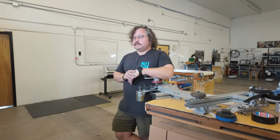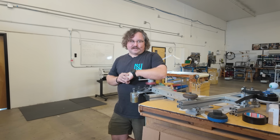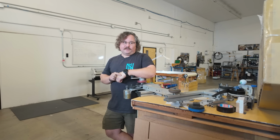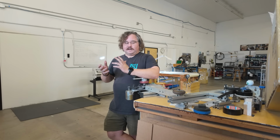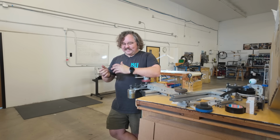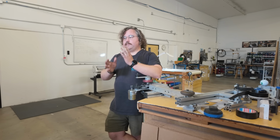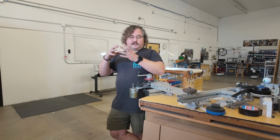Any little tricks? Yeah. We try to keep our tensions as balanced as possible. That's the biggest trick, I guess. And I don't know if there's any specific tricks to that. I mean, obviously you start with truing the wheel and then trying to move the imbalances of tension around the wheel a little bit until you get a true wheel and a wheel that is extremely balanced.